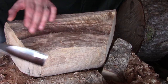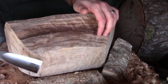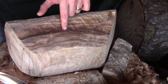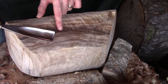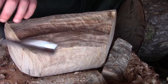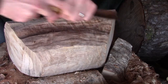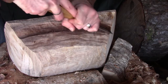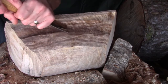I want to see how that works out first, and if it's not as concave as I want it to be I'll come back later on. What I've found with this eucalyptus - and this is the first time I've really used it properly as a carving wood - is that when I get to roughly the centre, which is not unusual for a lot of woods, it no longer wants to cut towards the end of the piece. So I need to work from here forwards up to here, and then when I finish this side I need to flip it round and work the other way. This is where having a really sharp gouge comes into play - it's cutting really smoothly. This is quite a knotty wood and it does like to split off in little clumps, but having a nice sharp gouge really helps with that.